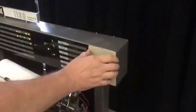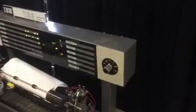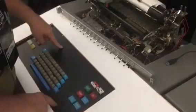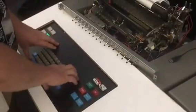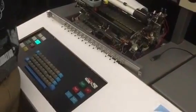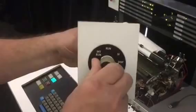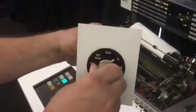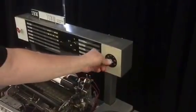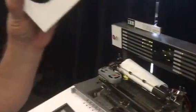This one part is from a real 1130. All the rest I sort of manufactured — pouring the plastic, making the decals. Used a water jet to cut this. Got an old keyboard, put on new keys to match the 1130. Did layers of paint and lettering on the panel and all. That's awesome. But the one real part was because my modern switch doesn't match the angles of the IBM lettering, whereas this real one does match. But I keep it around just to prove that it was authentic.